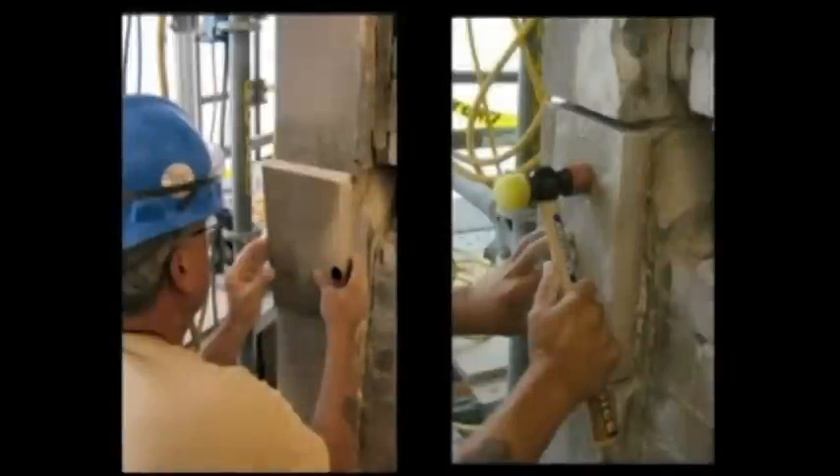The stone is laid on a piece of carpet or other soft material to protect the face while grooves are cut into the bond side. These grooves ensure the enlargement of the stone surface area and promote better adhesion and bond strength. Grooves are also cut into the existing wall surface to receive the piece. The replacement stone is carefully dry-fitted to ensure uniform joint size, with wood dowels of the correct joint width used to space the joints. The stone is cut on the bond side with curved edges to allow the natural hydraulic lime bond mixture to flow around the piece as it is tapped into position.